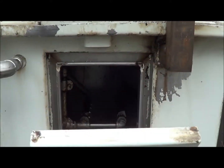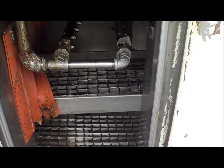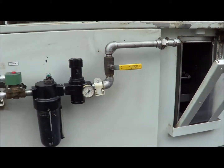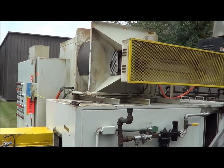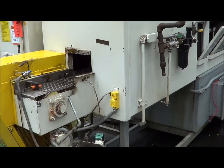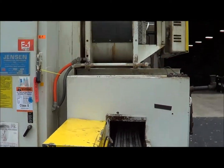Stage 3 is just a rinse off, and that rinse off does cascade down into the stage 2 wash compartment. Stage 4 is a heated air knife blow off. The entire washer is steam heated — both the first three stages and the fourth stage, which is a steam heated air knife dry off.